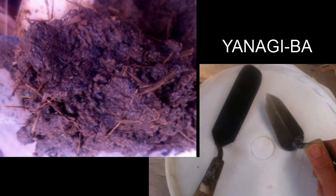This sandy bevel material is made from a healthy dose of sand added to the mix that you use for the shape coat or brown coat. By adding sand, you're essentially creating a plaster that's highly unlikely to budge while drying. I learned the consistency by feel. I wish I could pass a ball of the material around, but I wasn't quick enough to recognize what was happening in my life. Here's what I suggest.